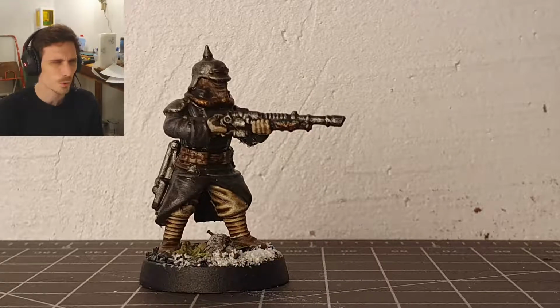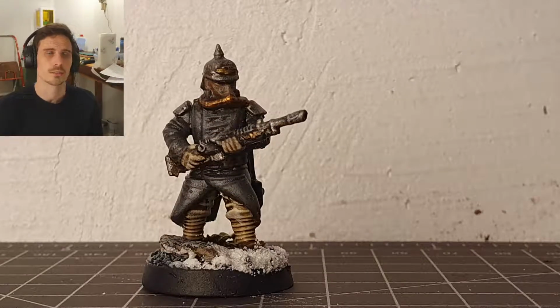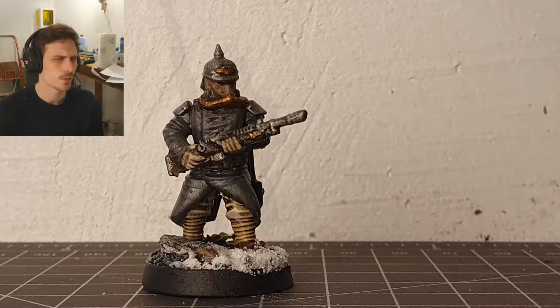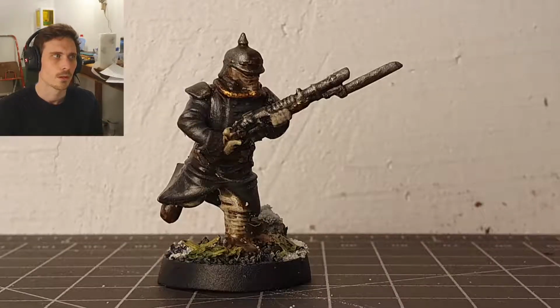I am not quite sure why, really. One of the things I ended up doing on the advice of the great internet was that I actually sanded down my build plate a little bit. Something to do with the standard adhesion on the build plate of the Photon S. It's too uniform, right? So the resin doesn't really stick to it.